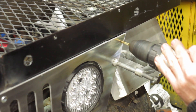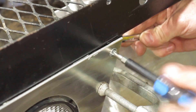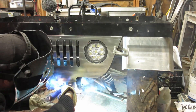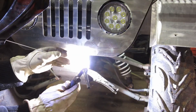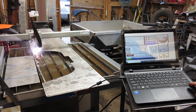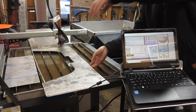Done with the CNC for a little while. Now we're getting back to some hand tools — drilling, mounting, doing some fabrication and welding. Here's something basic but useful I just figured out in Mach 3: if you want to make a straight cut across your metal, turn down your jog speed to about 50 inches per minute, manually start the torch, and use your arrow keys to travel it across the work. Once you get to the other side, turn off your torch and you've got your piece cut. Just a nice simple tip.